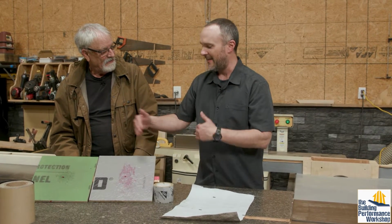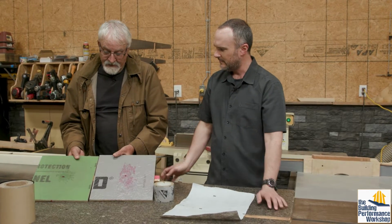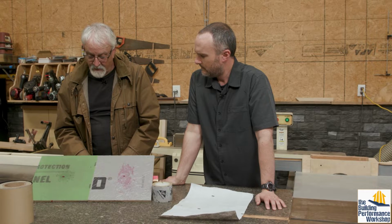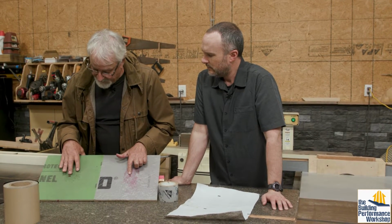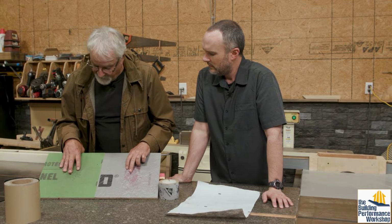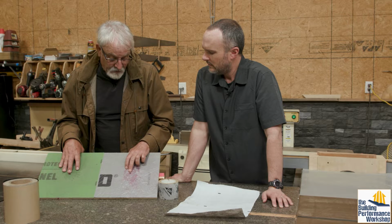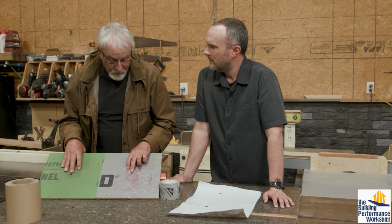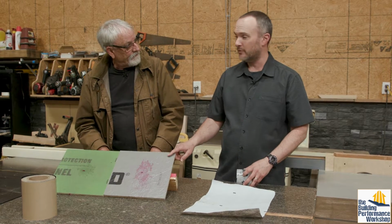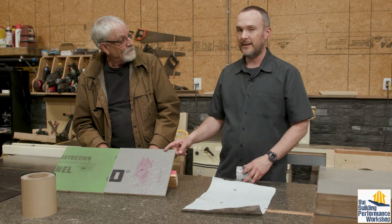It's different. And I think that's the important thing that I want to make sure that our audience hears. Yeah, it is. And as we said, when it comes to failure modes of this, they're really the same. And as you can see right here, overdriven nails. That's kind of a failure mode right there, especially in the reservoir type cladding, brick or stucco or something like that, that could be a problem. This one, though, just to be clear, is not approved for roofs. Is that right? It is now. Is it really? Yeah. Oh, thank goodness.